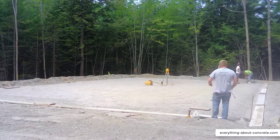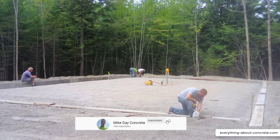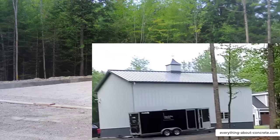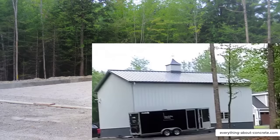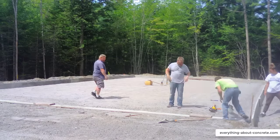This video is going to be about forming and pouring a 60 by 36 concrete slab. This is a 6 inch thick slab with the edges thickened to 12 inches. We're going to go through the forming right here and get it formed up. We're going to put down the vapor barrier and the rebar. This is what the garage is going to look like — a big metal garage building. That garage is also on the same property.